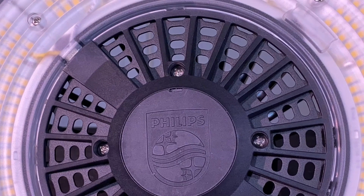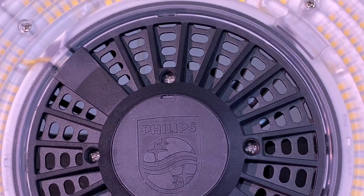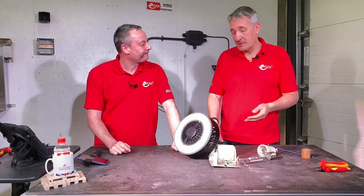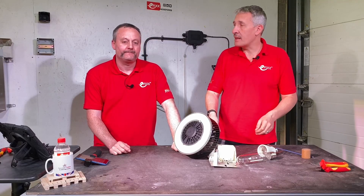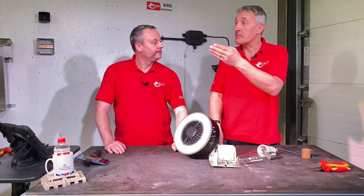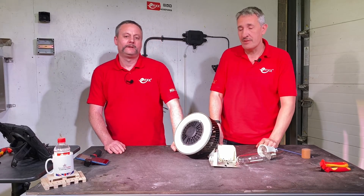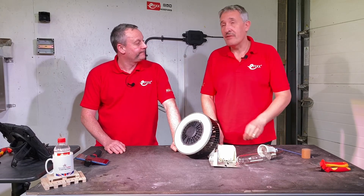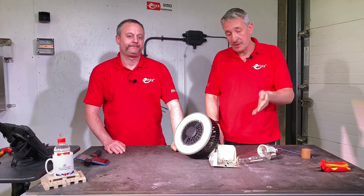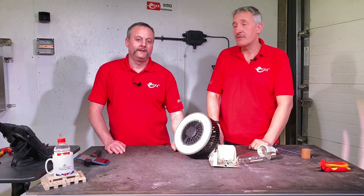What about colour temperature? This comes in 4,000 Kelvin, so again matched to those HID lamp sources — the white light you'd expect to see in retail, and possibly an improvement in some factory environments. It has a colour rendering index of 80, which is pretty high for this type of light source and is probably better than the one you're replacing in the first place.